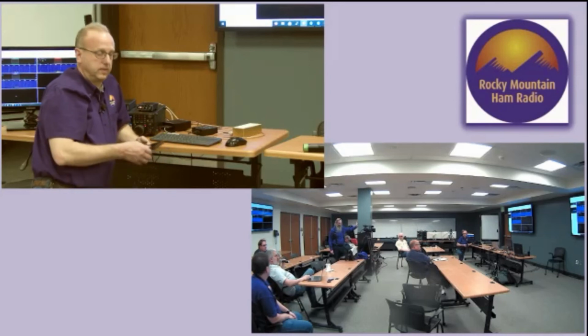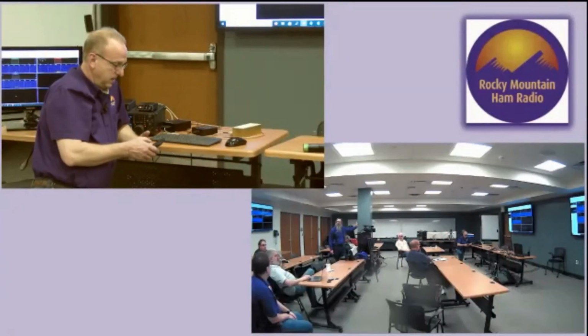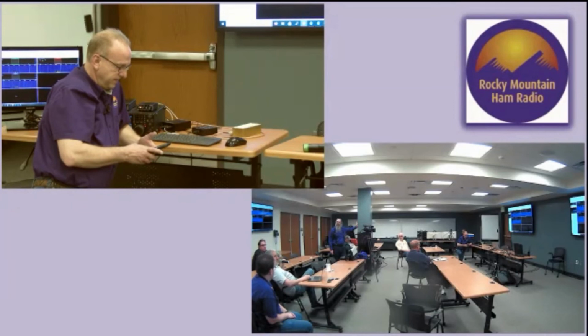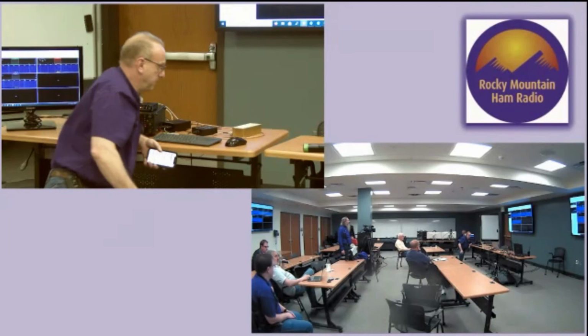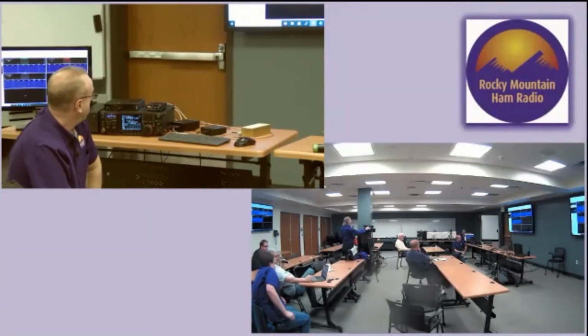The Serbian filters, they have a 4 megahertz wide. It looks like a 1 megahertz wide and a 2 megahertz wide. Which one are you using there, John? This is 1 megahertz, 50 to 51. The 1 megahertz, that's 99 euros. Yeah. It was not a bad price. It was a little over 100 bucks. Well worth it. Definitely a good piece of hardware to have if you play weak signal. And it even has the bandpass.